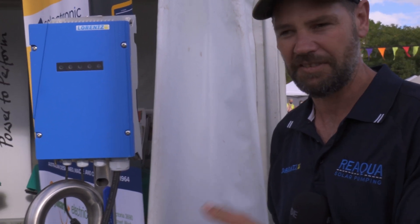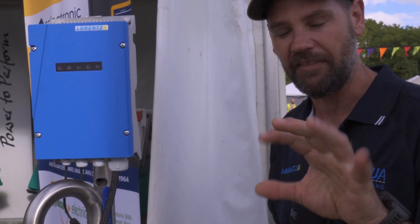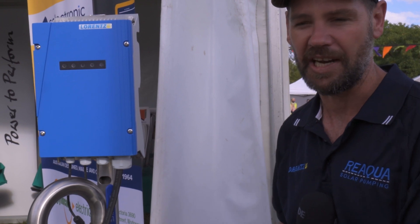So you don't have to size the PV to exactly match the demand of the pump — you can blend. Yes, correct. Coming in from the mornings, evenings, cloudy days, you're always going to have a proper set point where you can actually irrigate at that rate. I guess it also means if you're running off a diesel genset, you can ensure it's not running on low load if you schedule it for daytime operation. Yes, right — so much versatility.